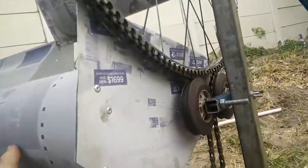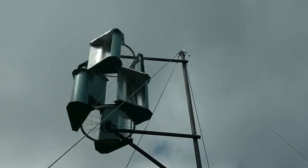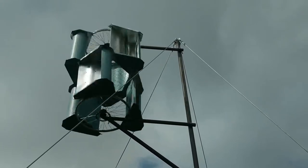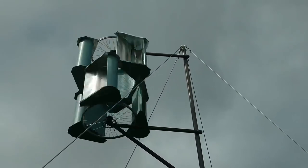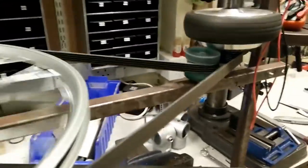I tried to get the bike chain drive system to go. It was worth a try just because bike chain is very easy to get around the world — and automotive belts are as well — but there needs to be about two and a half meters circumference, then cut down for width to fit inside the bike wheel. It doesn't work. The bike chain doesn't work — it was never likely to. But I'm going with this automotive belt, a skateboard wheel as a tensioner pulley halfway along the bottom horizontal span, and mounting the alternator onto threads in the main mast to wind it in and out for tension. That system seems to work fine and the materials are very easy to get around the world.